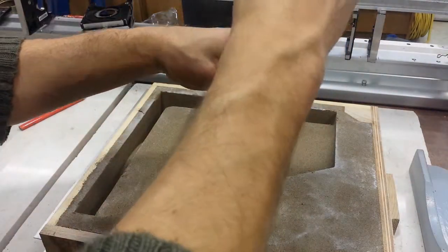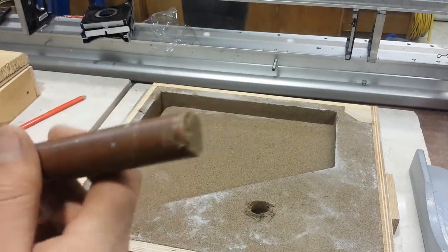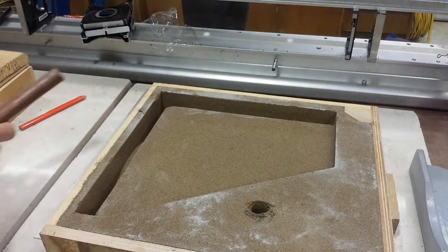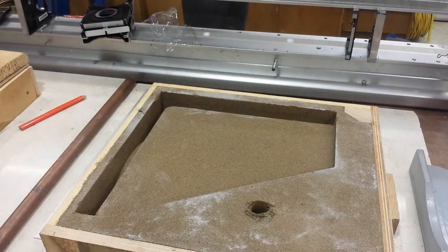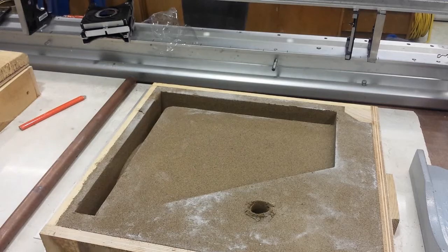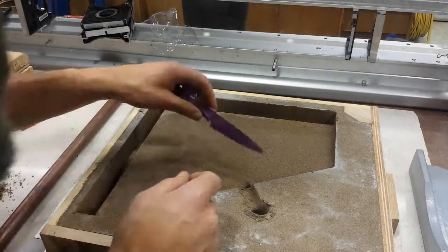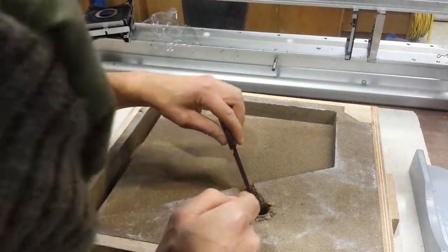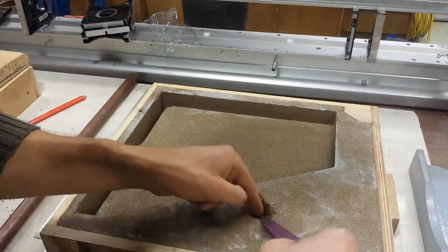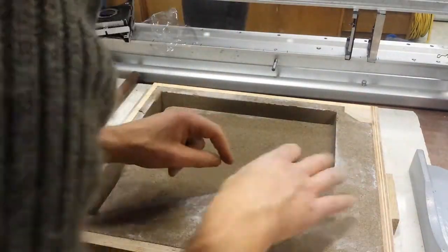Here I'm just making a riser for the aluminium to flow into the mould. That's left a nice hole from taking that plug out. We just need to tidy up that hole and join it to the main pattern. You can get all kinds of special tools to do this, but I find a simple knife works fine. Then we just want to round over the corners and smooth them off with the finger so that the edges don't get eroded by the in-washing aluminium when it comes into the mould.